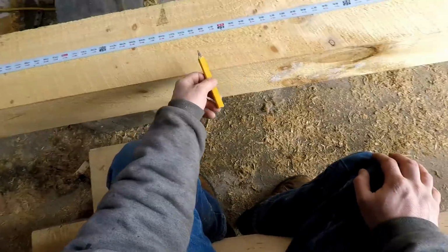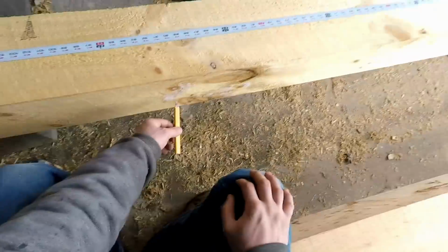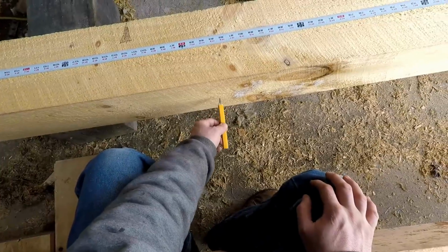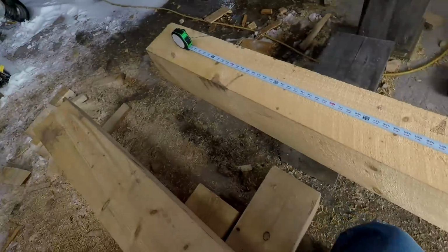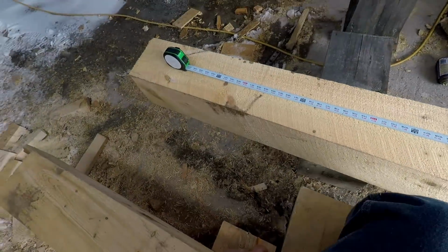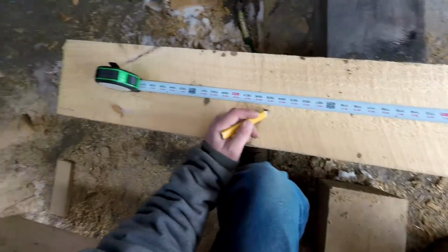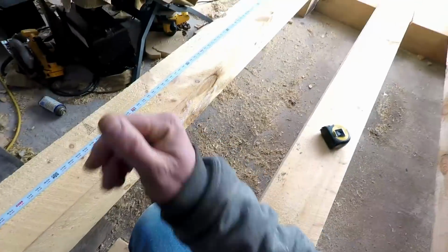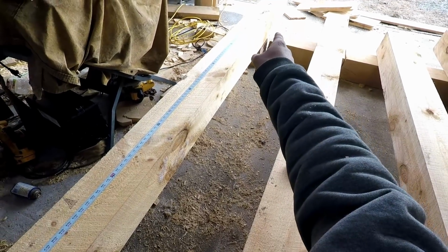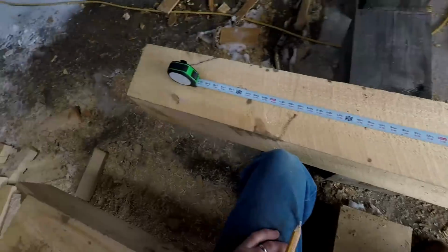So we really need to watch for our structural integrity, and you really want to pay attention to what's around this, because you are removing meat out of the middle. And judging from these knots the way they are, this meat in the middle is going to be your most important for structural. How much room do we have to go up before we hit another big group of knots? Let's see, we're at 10 feet 5 here. We can move this whole thing up and avoid that knot cluster, and that's what we're going to do. Only problem is I don't want to go too far because I don't want to be trying to timber lock through those knots to hold it down, because it'd be a good spot for it to break out.